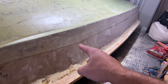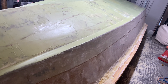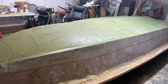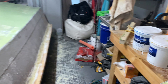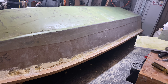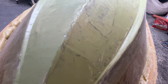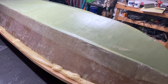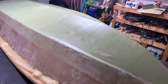I'm going to sand that edge on the 1708, and on the sides I might just do a high build primer because they don't need as much work as the bottom. The bottom has the first full coat of Total Boat Total Fair — that stuff's expensive and it used about three-quarters of the two-part jar. What I'm going to do is high build primer the whole boat, block it, find where I need to fare more, and go back and fill those spots. This week I'll probably get the spray rails fixed up and glassed in, then sand all weekend.